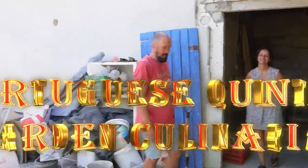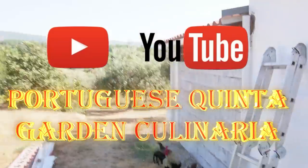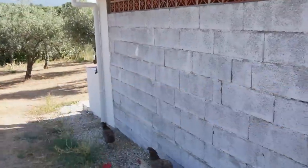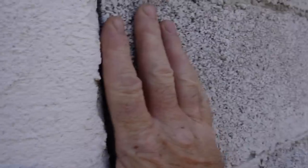So what we're going to do today is put a coat of render on this wall and finish it. Just a one coat render, so we're going to show Steve how to do that so he can finish them all himself. One coat on this because it's only thin here. We've only got 10 mil or so, so it's going to be one thin coat and then done to a finish. So he'll know how to do a finish after we do.